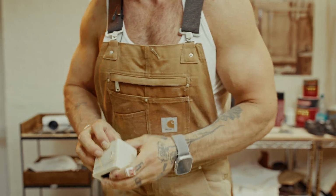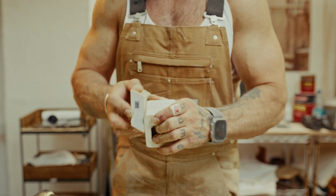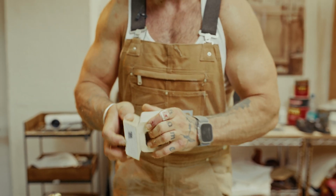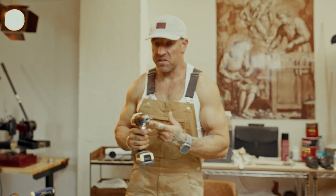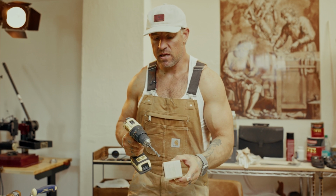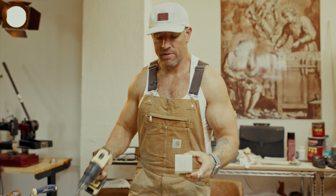Not that close, but close enough. Again, a drill press would be good, or just a jig or something. Just kind of sanding down the holes. If you have an 11/32 bit, something just barely above 5/16, you don't need the teeth to bite in this hole. That doesn't matter. Just having it slide through is fine.